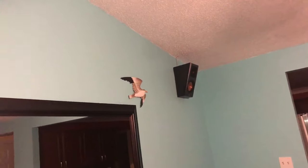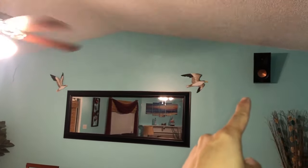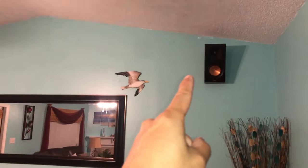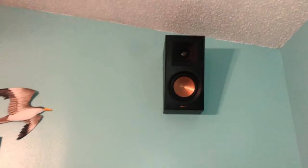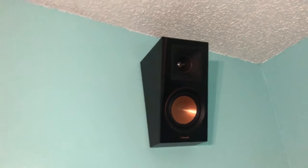At first, I thought I would like the setup where I had the speaker wire coming from the ceiling and going directly to the speaker, but I actually redid it again and put the speaker wire through the wall instead. What I had to do to accomplish that was use the same technique as I did with the ceiling and stick that steel fish tape through the wall and then pop it up through the attic and then tie off the speaker wire and pull it through the hole.